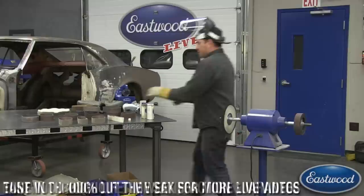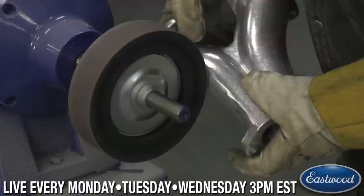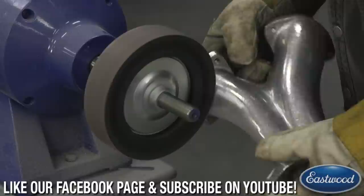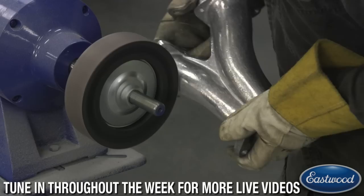I'm on 400 now. Depending on what you're doing, you can jump grits a little more — we're going from 320 to 400, which isn't that big of a jump. If you're trying to do a really nicely mirror-polished part, it's important to hit every step. But if you're just trying to clean something up, you may be able to jump a little quicker between them. It's so quick to change these bands that it's almost not a big deal to just do the 400.